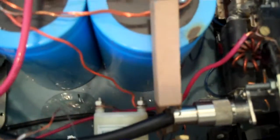So there's not a lot of room, and then the output of the unit comes via the coaxial cable and into the filter board, and the filter board's turned upside down so you can't really see it in order to fit in here, and the output of that feeds into another coaxial cable which goes out to the relays. And down here is a little power light which comes on when the amp's turned on.